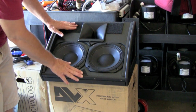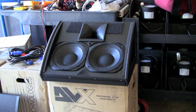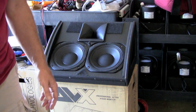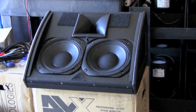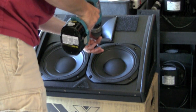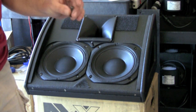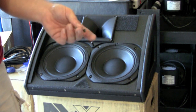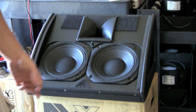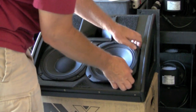We've got what looks like three ports on it. I'm going to pull out one of these speakers and pull out the horn to get a bit further into it. We've got the last screw coming out of this 8-inch neo and as you can see these are threaded — not sure the millimeter of them, but it makes it nice for when you have to pull drivers in and out so you're not going to strip out the holes where the screws mount the speaker.